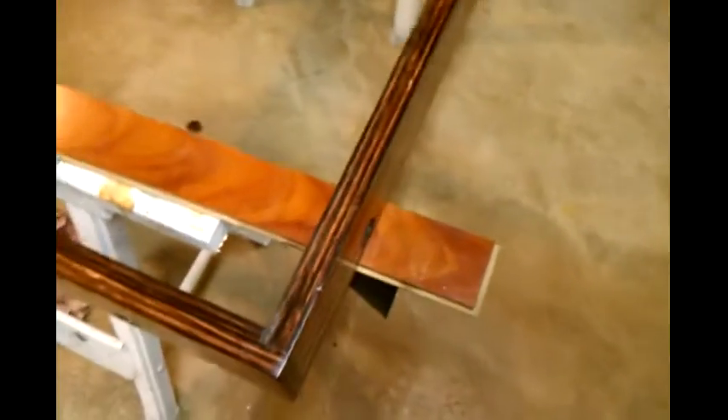I put that all together — this top is going to set right into here. These are my legs. I just did one piece, and this one has to be longer — about three-quarter inches longer than the other piece — so we've got a corner. I put a 2x2 just here to make it totally strong. I cut them at an angle — not square. We thought about square but I thought it looked neater as a triangle, and triangles are strong. I drilled the bolt hole through there — the hole goes through there and through there. They're going to bolt on like that.